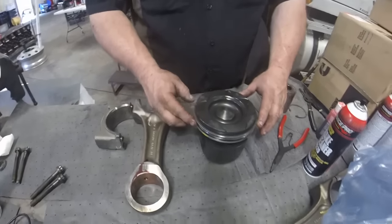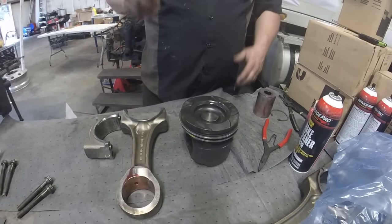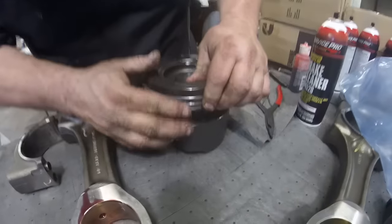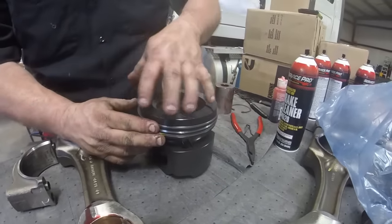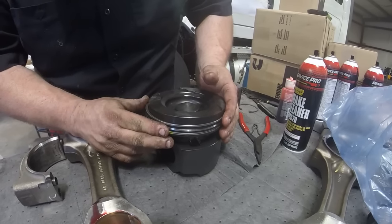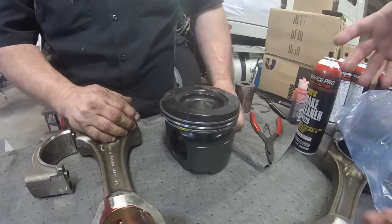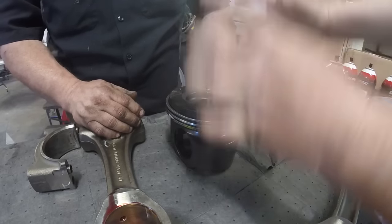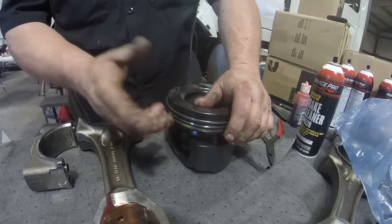See what I was telling you about how loose these rings are? They build them up really, really loosely to give flex against the cylinder wall. And you know, talking about your old pistons — see how far they sit in? Over time when carbon packs in the cylinder, it just comes out, out, out, and eventually the carbon in the oil on these new EGR engines builds up and pushes the rings outwards, so it scrapes harder and harder against the liner walls. That creates all the excess wear. And that's why I didn't see it on my engine — because I keep my oil really clean.